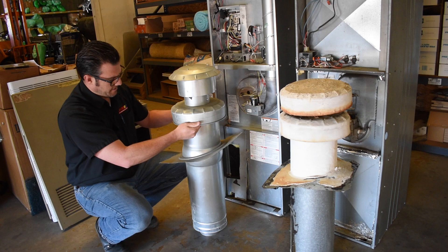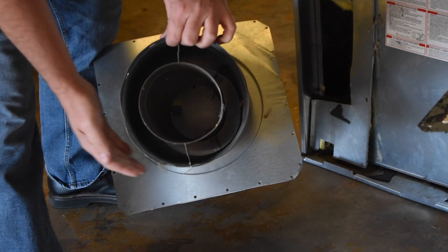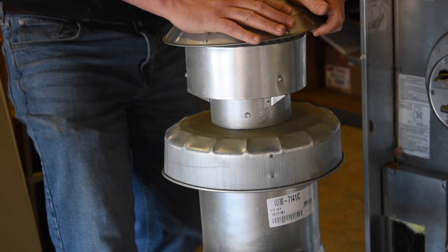This is not unique to mobile homes, but it's where it's seen most often. These furnaces use a concentric vent system where fresh air is brought down the outside pipe into the unit, used to mix with the fuel. The spent combustion gases then exit through the middle pipe to the top vent. It's a very important part of the furnace and does need to be replaced when you replace your furnace — at J&M Air Conditioning, they do that every time.